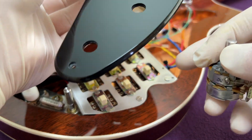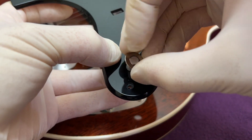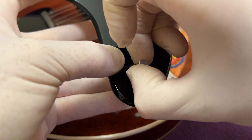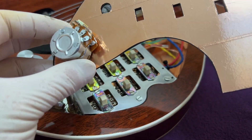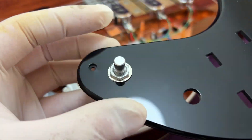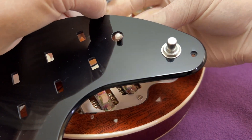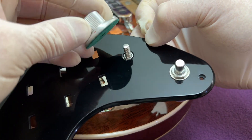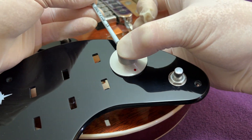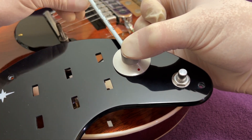Vintage analogue live setups and studio recording required control over tonal nuances such as the ability to dull the shrill tones that treble boosted trisonic pickups can produce. The only control he really requires now is changing between pickup configurations, and the all-important transition from clean to overdriven tones, which is all done using the volume control. Before implementing this modification yourself, you need to review how you use your Red Special. If your use case is similar to Brian's and you primarily play live and have no particular requirement to cut treble, then fitting the CAT RS SuperPot will give you more control over the range where the signal chain transitions from clean to overdriven tones. Recording direct-to-computer using an interface is popular these days, and a lot of tone shaping and equalisation can be done in post-processing — if this applies to you, there's also a sound argument to delete the tone cut circuitry and fit a CAT RS SuperPot.